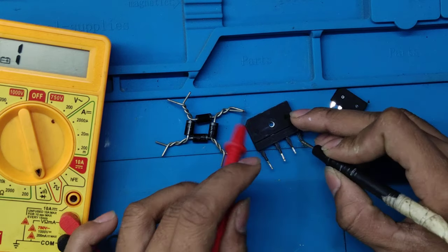In the rectifier, as you can see, you can read the marking. But in discrete diodes, you cannot always read it clearly. Like here, it is marked SBJ. This one here is D2SB — that is a 2-ampere diode. So I want to tell you that in a bridge rectifier, the difference between using a rectifier module and individual diodes is just this: one is a compact unit, the other uses 4 separate diodes with a little space between them. The rectifier module is fine, but friends, there is a big difference.